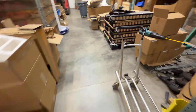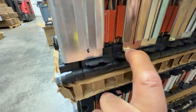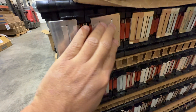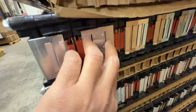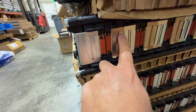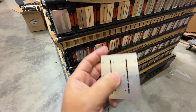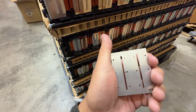Here's an example of a big module. These bus bars have little connectors that let you push a cable in and it doesn't come out — pretty cool. You put the bus bar in here, making sure not to touch anything else in the pack, then drive screws to sandwich the whole thing. Power gets transferred from the bus bar on top but mainly from the bus bar on the bottom. We have these bus bars on order right now and they're coming.